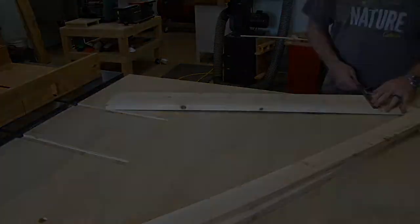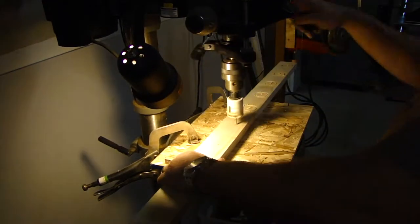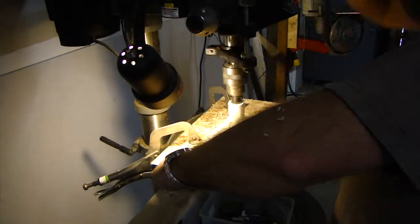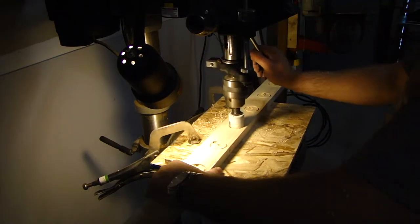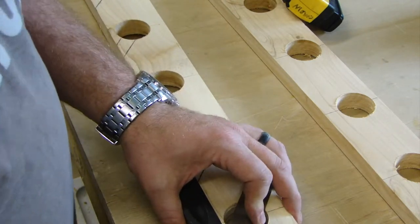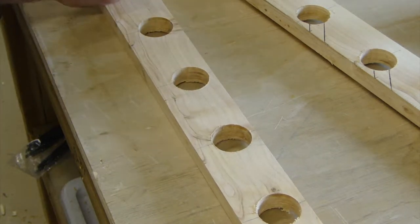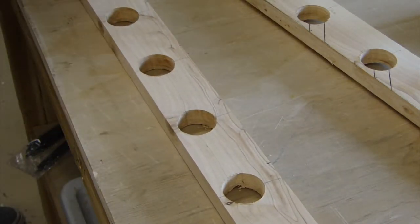These are going to end up in a T-shape. I was doing layout for the holes — what I like to do when drilling with a hole saw is punch a center mark, then use a Forstner bit or spade bit to cut a relief to give the sawdust somewhere to go, then come back and finish the holes on my drill press. I guessed an angle with my adjustable bevel gauge that looked like it would keep a rod in the hole without just falling out, by going past center where the hole starts to go back up.